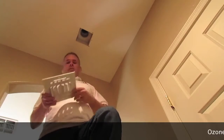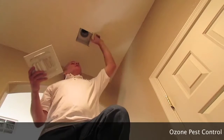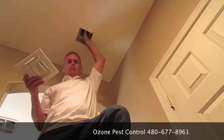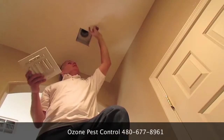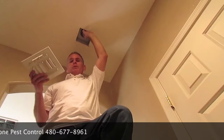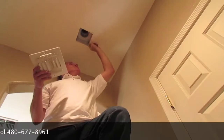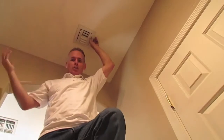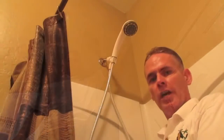We're inside the home now and we're going to show you a couple other areas that should be sealed from the inside. For the sake of saving time, I've taken the vent off. A lot of times customers say that scorpions are coming out of their vents — it's not the case. Your vents are sealed, but between the attic and the vent there's typically a gap where there's enough space for scorpions to get through. So you would seal this up with that silicone and then simply put the lid back on. Once you're done with all your air ducts and your lighting — if you've got high hats, you'd want to seal those off as well.